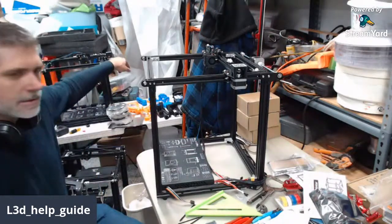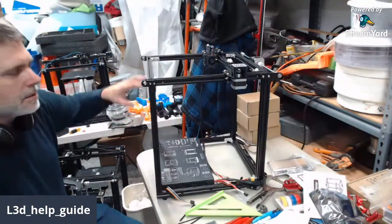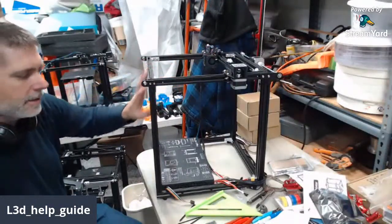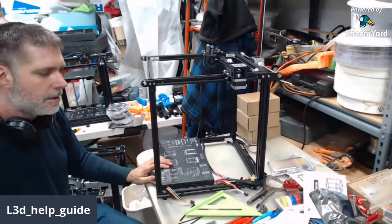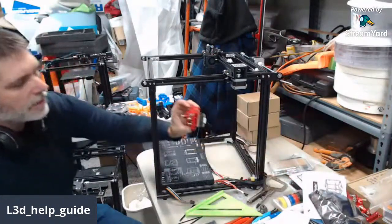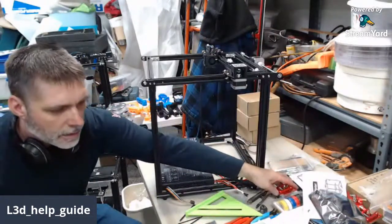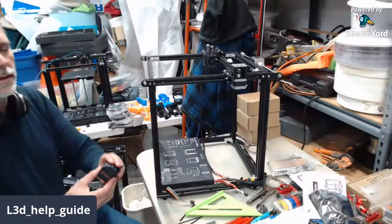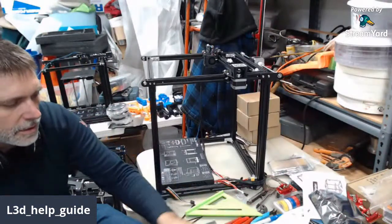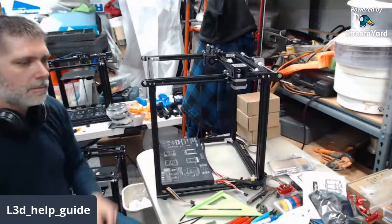I will be adding all of the accessories over on the table over here. We have the orange machine, the blue machine, the black machine. So they will get those accessories. We're going to be doing the hot end fix to all of them. We're going to be doing the wiring. We have filament runout sensors to add. Bunch of fun stuff to do. And then if they get here in time, these came with a really nice aluminum Creality extruder. It's perfectly adequate. He's going to be putting on an equivalent to the Bondtech BMG on here. So you get the 3-to-1 gear ratio, which gives you a little bit smoother print. And we're going to make these things set up to do some production work.